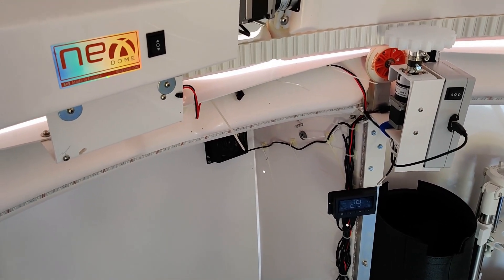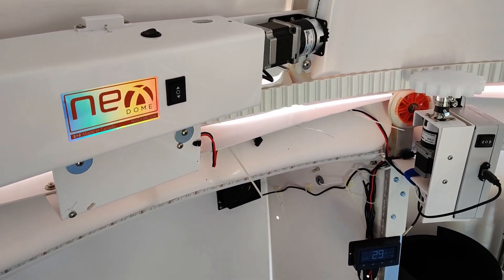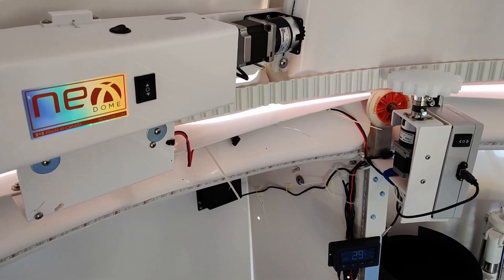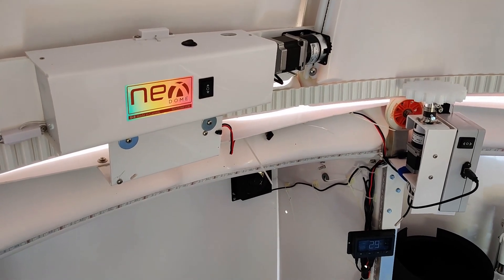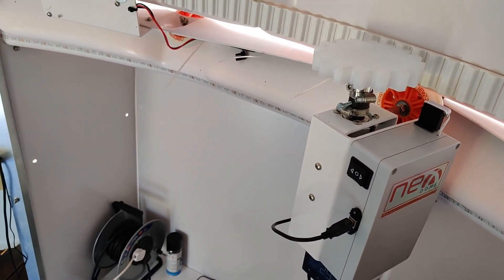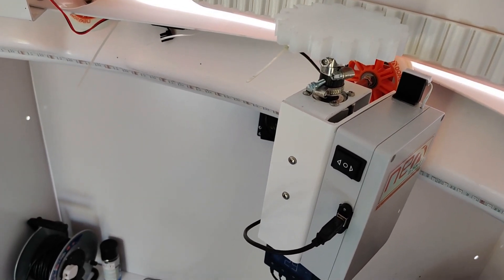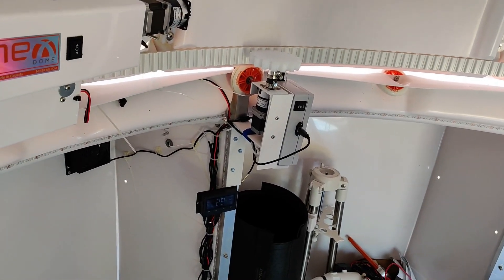The other problem that seems quite frequent is the shutter disconnecting for various reasons. I think the Zigbee module may just be losing its signal between the two units. I need to look into whether there's additional antenna that can be installed, or whether the Zigbee module being next to the motor is causing interference. On the shutter retention kit and back rollers, another issue was the tightness — so outside I've added three additional washers to lift up the wheels, and that seems to be giving plenty of space now for the rollers.